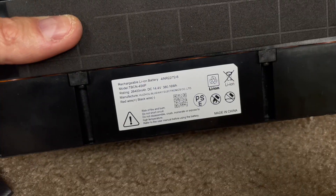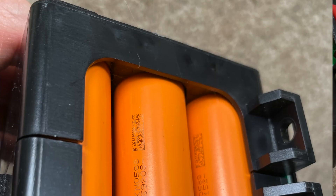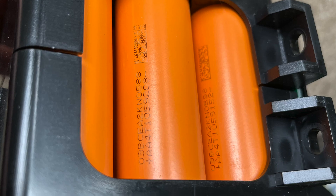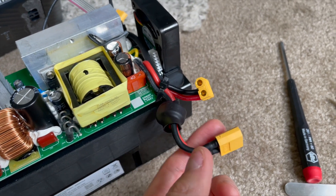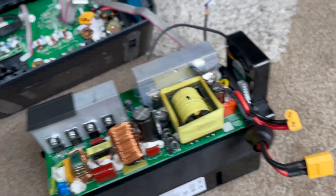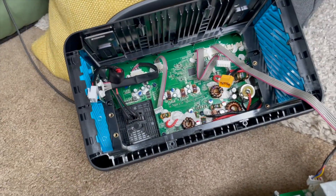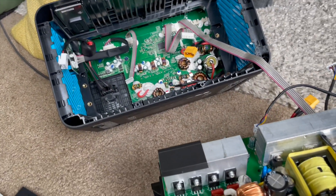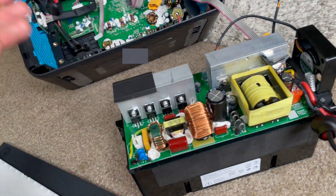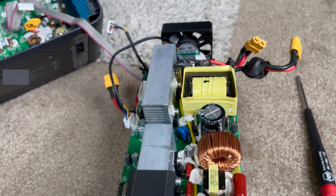Now you can really see through the unit. Here's the battery information — I couldn't find the battery references. There is a part number on the side of the battery but I can't find what it pertains to. There's another ferrite on what I think is the input to the battery from the inverter, and obviously a choke going out to wherever you're powering — both to provide noise-free power to the device and to protect it from noise being back-fed into the system.